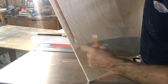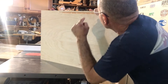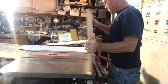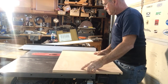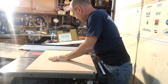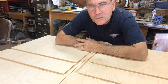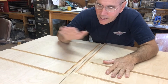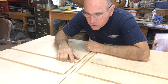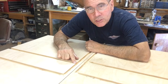I got myself a little blind dado, and now I've got to cut some more dados. I got all my grooves and dados cut and I didn't do anything backwards — I've got a left side and a right side. I still need to clean out this little corner where I have the blind dado, and I'm going to do this the old-fashioned way, just with a chisel and a mallet.